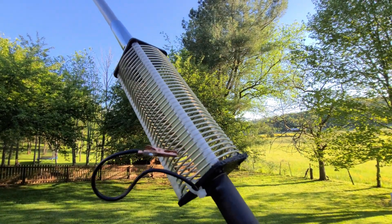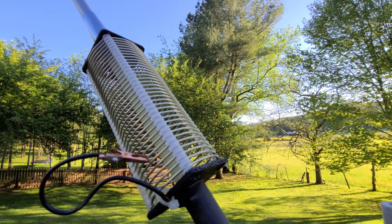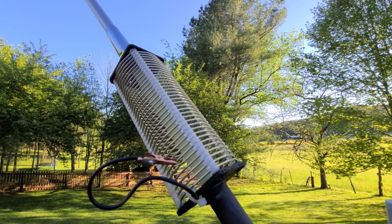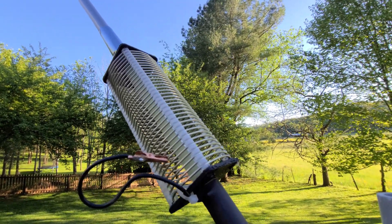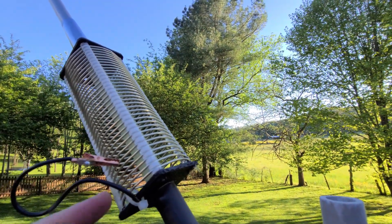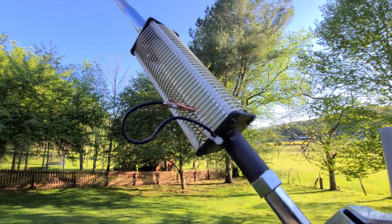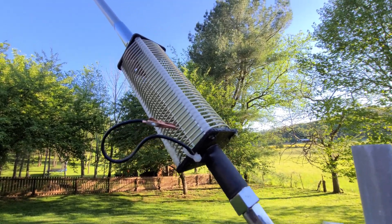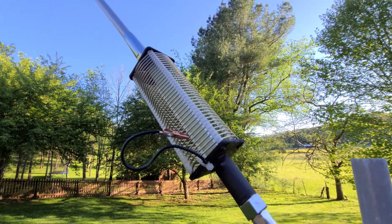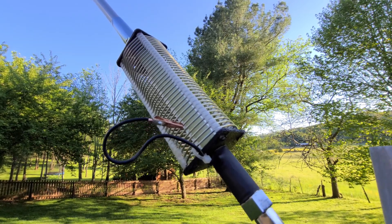For 20 meters, you don't actually need the coil at all. Normally when I want to do 20 meters I just take the coil off and run the aerials only — the telescoping aerials. The instructions do say you might use this coil for other bands like 30 meters, possibly for digital, but I don't do digital at the moment. Right around six coils up seems to be the sweet spot for 40 meters for me.